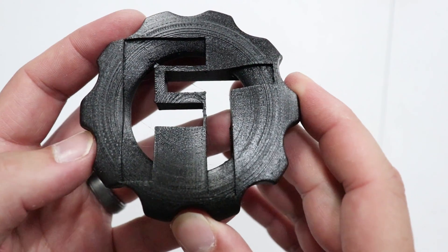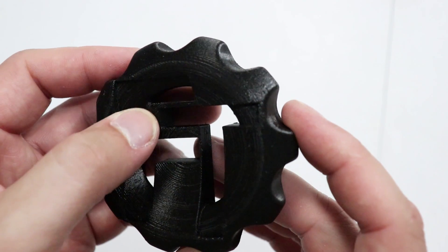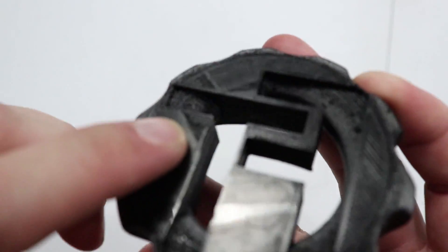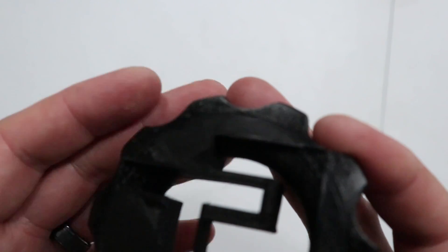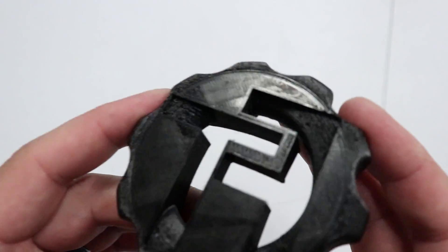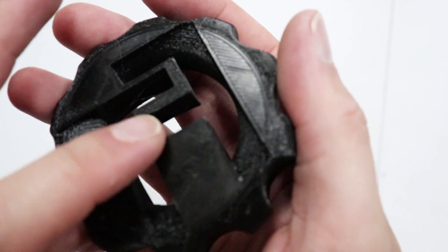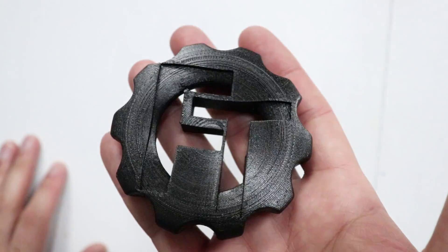Here's the Carbon Fiber Extreme Black PETG from Atomic Filaments. This looks gorgeous — really nice sheen to it. This was printed on the CR-10S with an all-metal hotend and a steel nozzle from Micro Swiss. Looking at the bottom, there was one little anomaly on the first layer — I'm not sure if it was something on the build plate or the slicer, but it just looks a little funky right there. Over the support, everything came off very easily. It is really hard to photograph black, but it has a really nice shine. Once I wipe off the glue stick residue the rest will really shine. I do print PETG on PEI with glue stick, and this came out absolutely gorgeous.